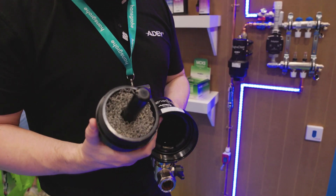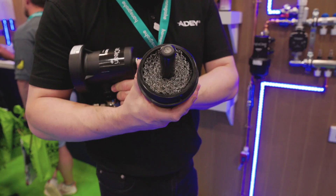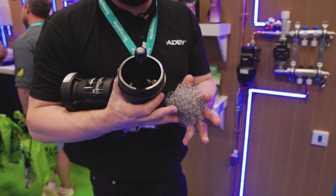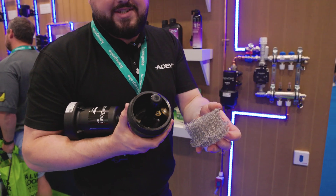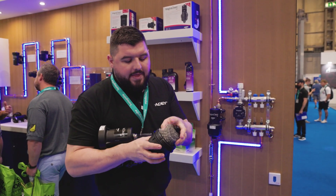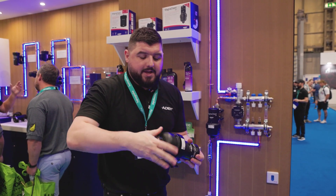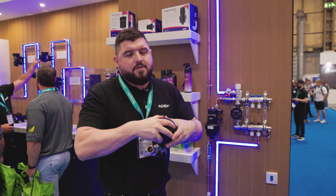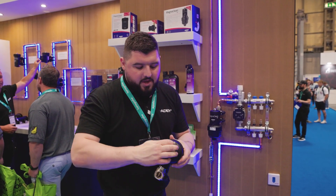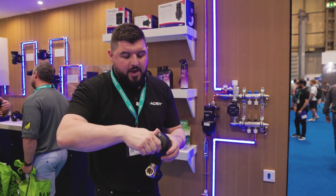Because low temperature and plastic is a breeding ground for microbiological growth, which a magnet on its own will not stop. So we put this mesh gauze in place to capture your non-metallic debris — just give that a clean on the surface and put it back in. At the bottom we also have a dry pocket magnet. If you've got a system with underfloor heating downstairs and radiators upstairs, just remove the magnet and give that a clean as well.